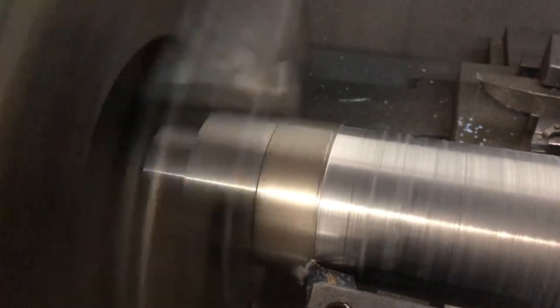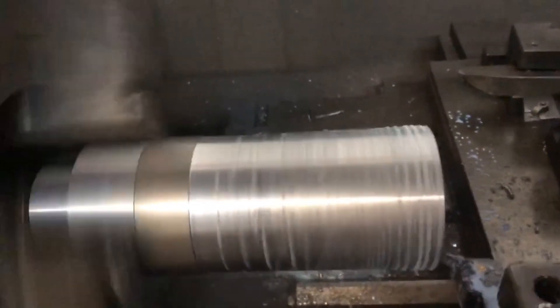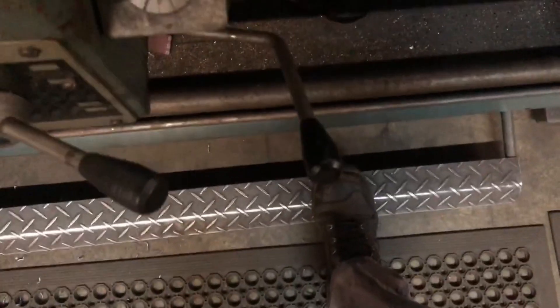You can see I'm machining down to my Sharpie mark made earlier in the video, taking fifty thousandths at a time. My starting size was three-inch material, so I'm going to have to remove five hundred thousandths — half an inch worth of material — a lot of chips — to get down to my two-and-a-half-inch target size.